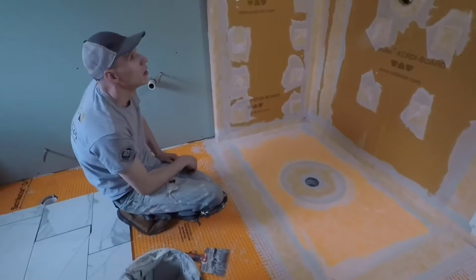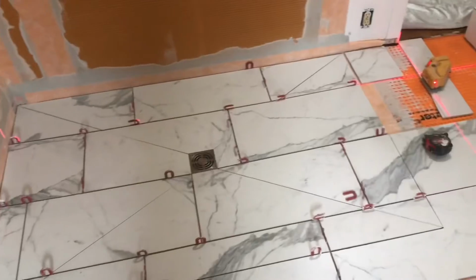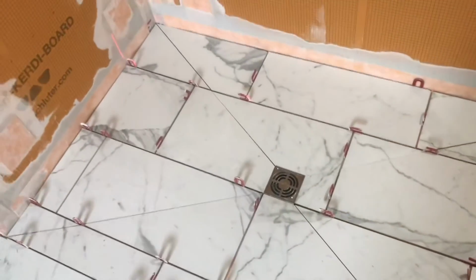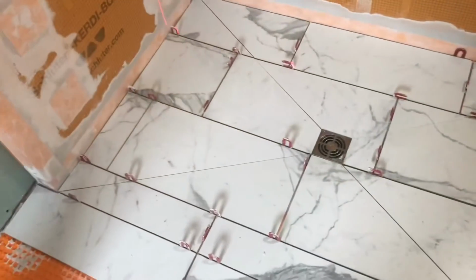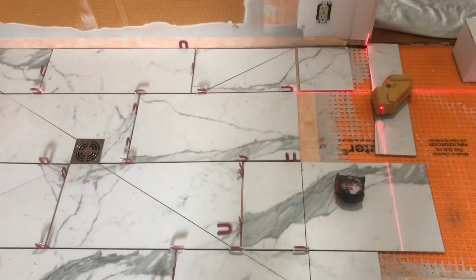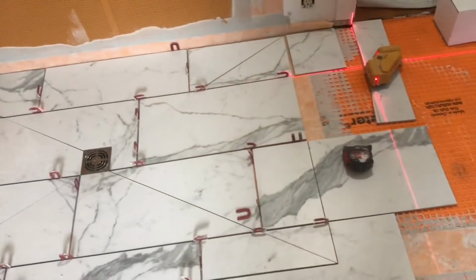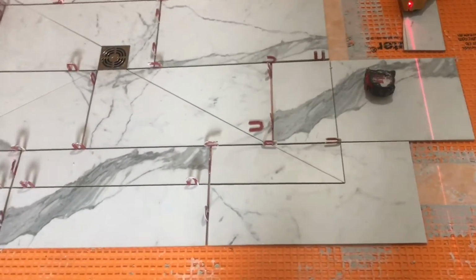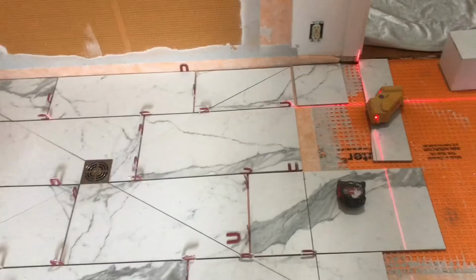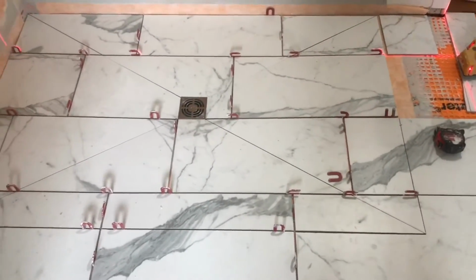Waterproofed. We are ready to lay our shower pan tile out, and we'll get started on that. So our curbless tiled shower, we've got our shower pan tile cut and laid out. I'm going to let you kind of see what we have going on. You can see from the four corners of the drain, we went to the four corners of the shower pan where the slopes are. So all quadrants slope right to the drain. We did a perimeter cut here that's in line with the outside edge, and then an extra cut here so that the shower pan is outlined. And then we were able to keep all the cuts of the tile so that the pattern, as you can see, continues to flow right through our cuts. And so it'll be a lot more seamless, especially when we put the gray grout in it. So that'll help blend it even more. So be sure to keep watching as we start laying this tile floor out, and we'll go from there.